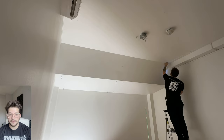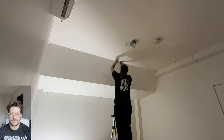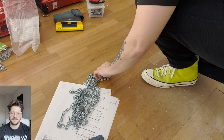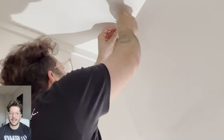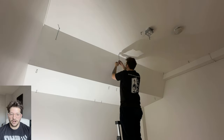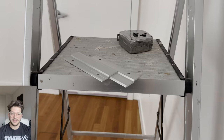I line up the first two pieces of hardware on those front clouds and use my laser to map out the following sections of hardware. I'm getting all of those anchors into the ceiling and drilling pilot holes so that the anchors screw in exactly where needed. Here is the chain for the longer sections where these clouds need to be suspended. I'm using bolt cutters to get the chain cut to size, counting the links to make sure they're consistent between all mounting points. I can thread the chain into the locking carabiner, thread it down to make sure it's locked in place, and then place another locking carabiner that locks into the eyelet screwed into the actual cloud panel. On the back pieces of hardware, the chain sections are shorter — only three links to get the desired height from the ceiling.